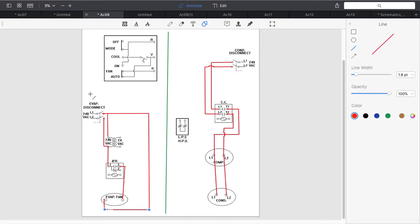Now let's talk about low voltage. So far I've connected everything in line, but we still don't have the control voltage in to make any of this work. We're going to have a number of wire jumps in here, and that's why when you look at a pictorial, you have to really follow the wiring. So I'm going to come out of my 24-volt transformer secondary, which is the low voltage side. I'm going to change wire color to blue, and draw in my control voltage